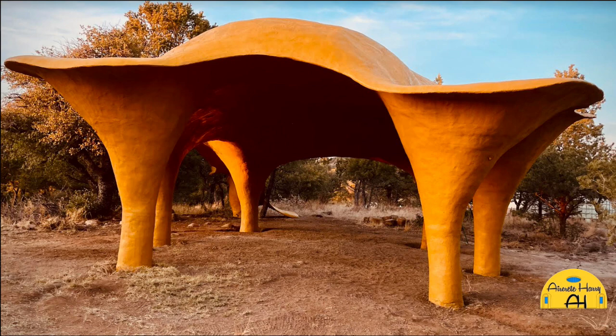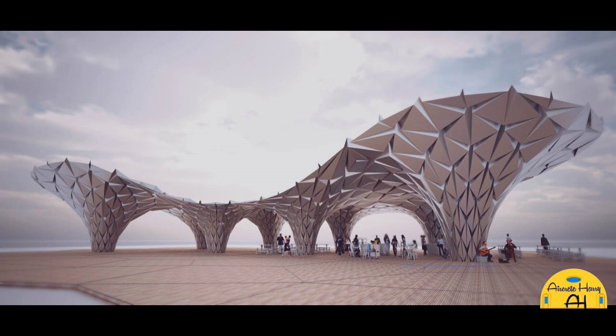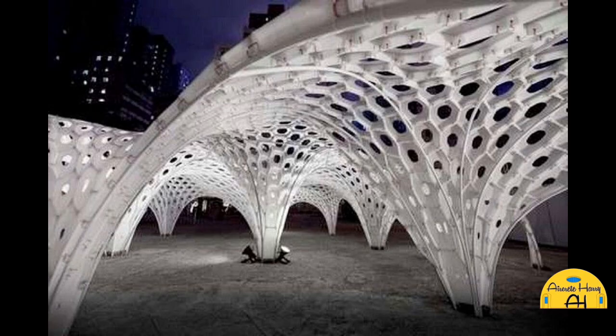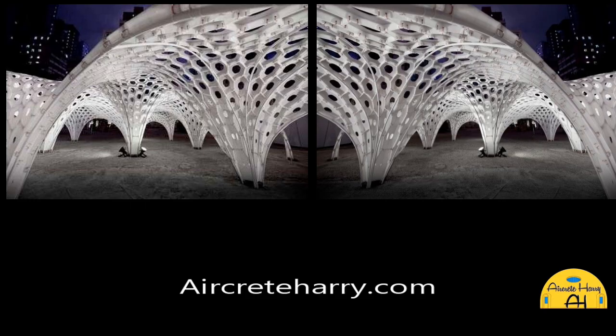And so other people are able to reproduce this using their own local materials, their own local fly ashes and things. And yes, 14,000 psi is massive when you consider most foundations are maybe 4,500 or 5,000 psi, even less sometimes for homes, could be a 3,500 psi concrete mix. To be able to take that same cement and, with the additives and the technique you suggest, get up to 14,000, it's incredible. It explains why this thin shell system works so well, because you have so much strength in the skin. It's insane.